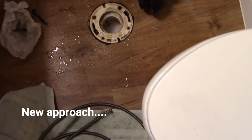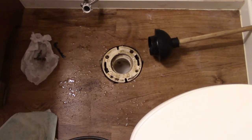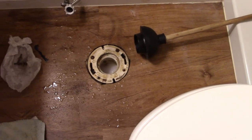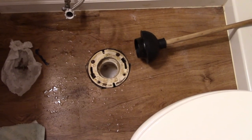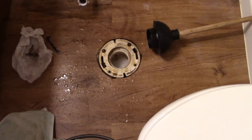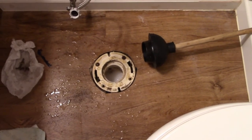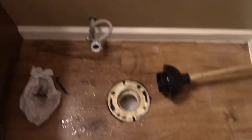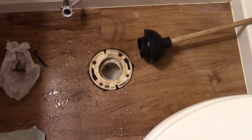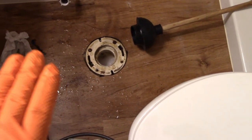You can probably see there's water sprinkled around the opening. We tried to use the spring snake but it only got so far and it really didn't want to get through whatever is in there. So Roger suggested I use the plunger and go on top of the base and plunge it down in. I used water from the hose, filled it all the way full, and then hit it with the plunger. I could see the water going up and down, so that was helping.